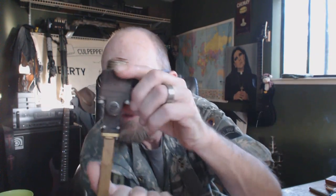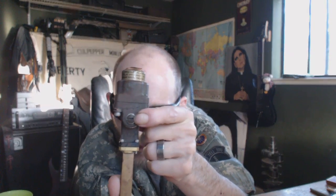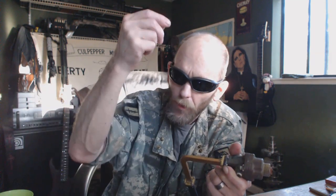Going forward, we also have an air connection here, because you have what's known as a dehydrator — it's going to be on the wall somewhere. It's going to pressurize this waveguide up to about three and a half PSI, pressure it up, suck that air out, and make sure the air is dry — put more dry air in and suck it out — because you can't have any moisture in here. Moisture reflects energy, which is horrible: it causes all kinds of problems with linearity, distortion, intermodulation, and all these things.